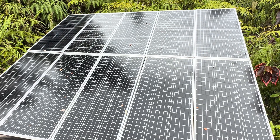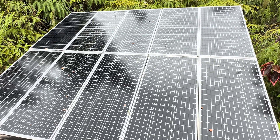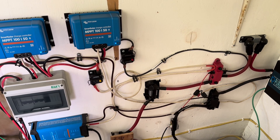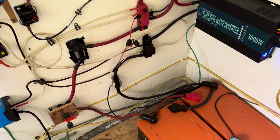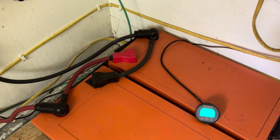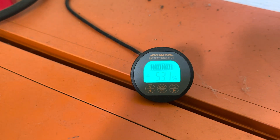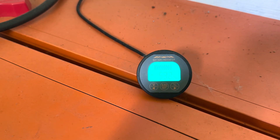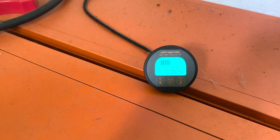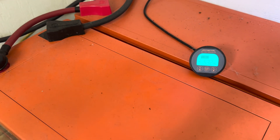This is 1000 watts worth of solar panels, which is what I use to drive the main house most of the time. I'm back on the main house system right here, and for the past few days this battery bank keeps going down because of the intermittent sunshine I've been getting. Yesterday morning it was at 20%, which is as low as I let my batteries go in general — even though I could drain them completely without really hurting them. Once they get down to 20% I switch over to a backup system.